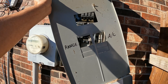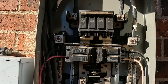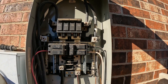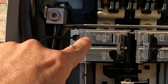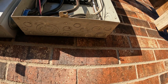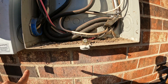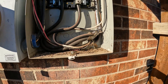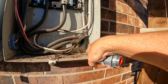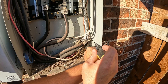This is going to be the main panel — range and AC — that's got the main 200 amp breaker right there. You can see all these breakers, going to be GE. Down at the bottom there are a lot of different knockouts. Something about these knockouts: when water gets in, sometimes it drops into your conduit, so I'm going to try to get this side knockout. It's going to be one and three-eighths, and that's what fits a one-inch conduit.